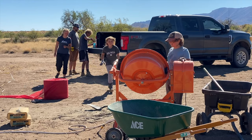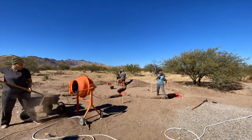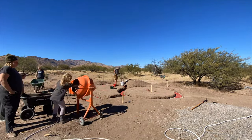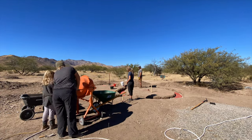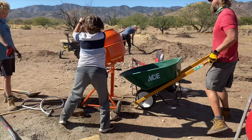The cement mixer — we put the sifted dirt directly in there. We have a ratio of cement and local dirt that we're using, and we use our long hose that's close to our water tank. Usually there's two kids manning that and they've gotten really good at figuring out the ratio and getting it to the right consistency. When we're done with that, we flip it over to the other side where we've got a wheelbarrow and dump it in.